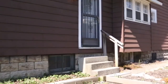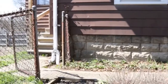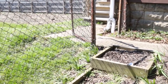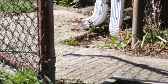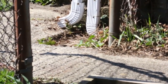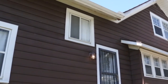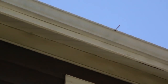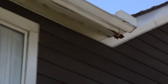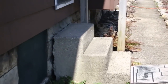It's kind of hard to see because it's not raining, but if you look up here, this gutter goes along here, comes down, supposed to, theoretically, leave the side of the house. But if you look right here, one, the way the concrete is sloped and the way the gutter stops, it actually all just runs right back to the house. And not only that, but it doesn't even make it that far because it's blocked up right there, because it's sort of falling out. If you can see, this gutter's screws are coming out, so the weight of the water pushes it here, so it overflows there. And it's all been dropping right there. See this whole thing buckled, cracked, dropped right here.